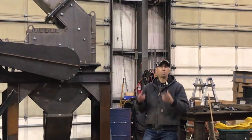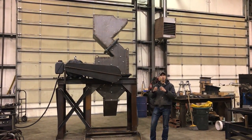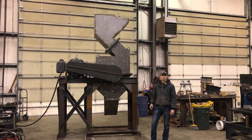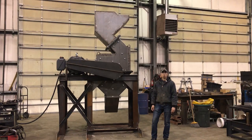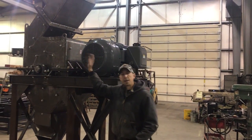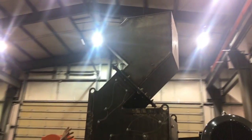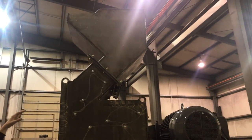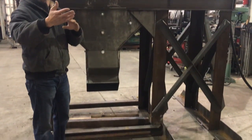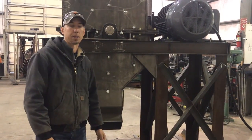For our demonstration today we showed it as a pre-shredder with a large four inch hole screen to just beat up the stuff and liberate what we could. The primary goal of a pre-shredder is to liberate larger steel pieces such as shafts and larger pieces out of transformers, starters, and alternators that you can then pick out before they run into a smaller machine like our 24 by 16 inch scrap line. This unit is powered by a 100 horse electric motor and the feed side is about 12 feet high. For this demo we fed it by hand, but in production you'd have a feed conveyor going up and then the material discharges down onto a conveyor belt where you can mount a magnetic separator or carry material to picking conveyors for manual separation.